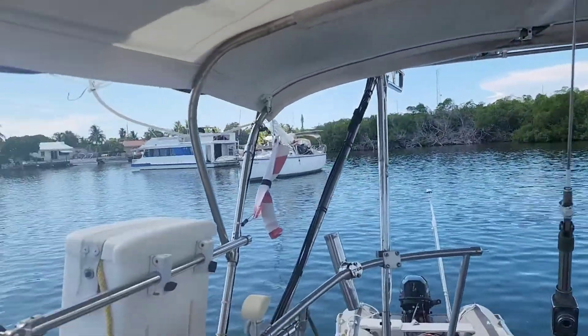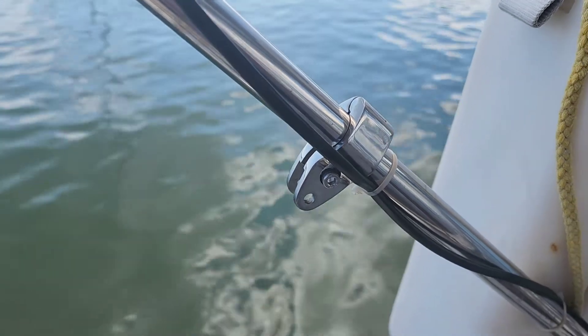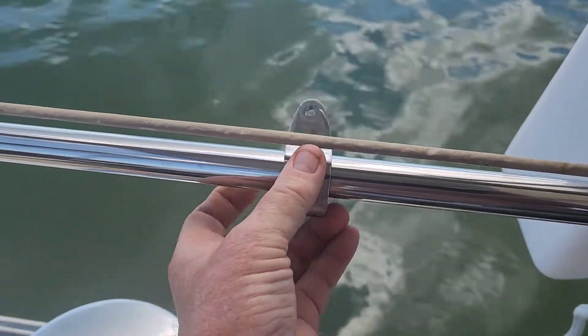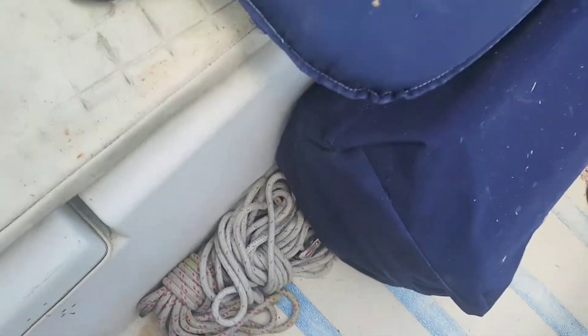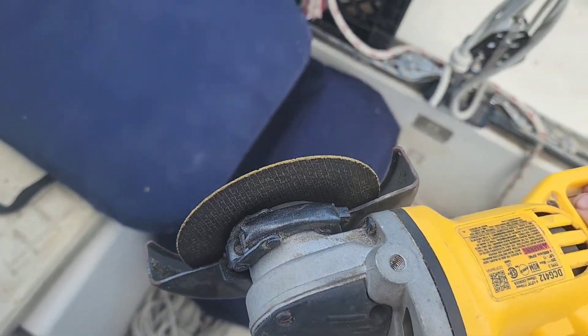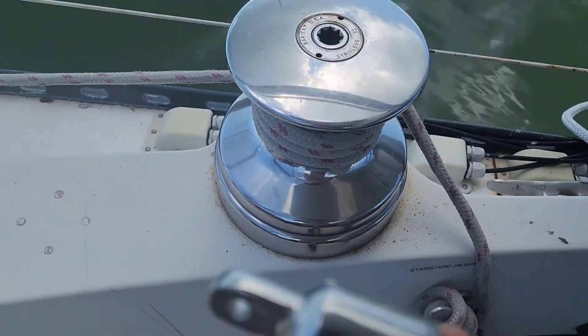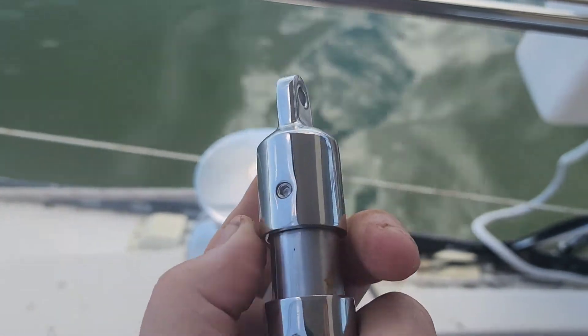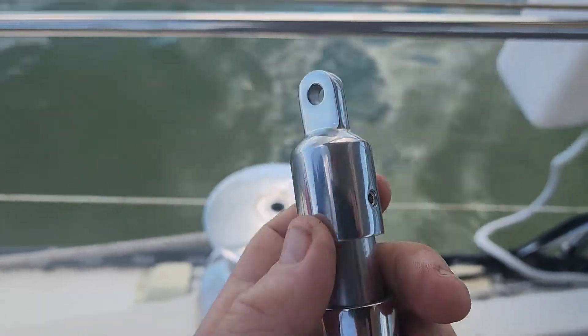So we're going to reinforce ours. We've got these wraparound connections that we bought — they just slide around and clamp to the tubing; you put a hex nut in them and tighten them up. Then using a grinder, which we have here, and a thin cut-off wheel, we cut pieces of stainless steel tubing to the correct length, put the eye sockets on them, and they're held on with a set screw that actually indents into the tubing so they don't slip off the end or rotate.